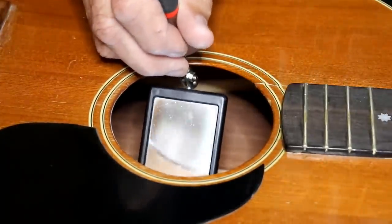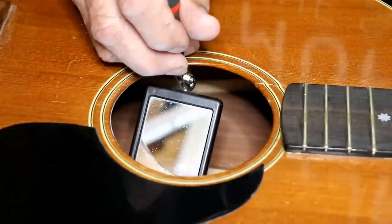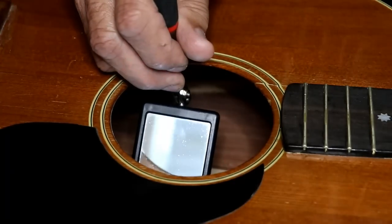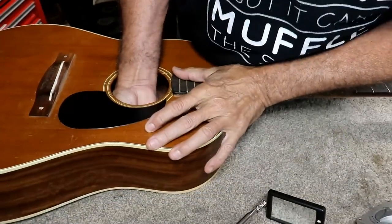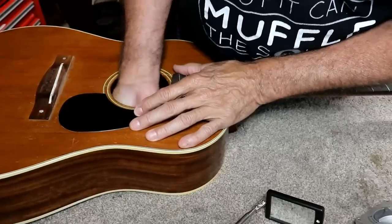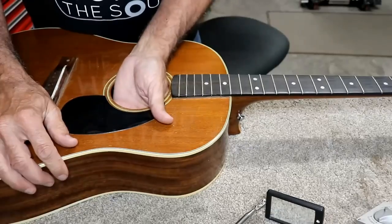There's another one on the other side. I'm going to get some glue in there and get some good braces on this, and maybe even try to force it up a little bit before I actually clamp it — maybe that'll help take out some of this underbow. I think there's several braces in here loose, including part of the X brace in the middle here. I've got problems. I'm going to have to try to fix a bunch of braces, and it may take me a little while.